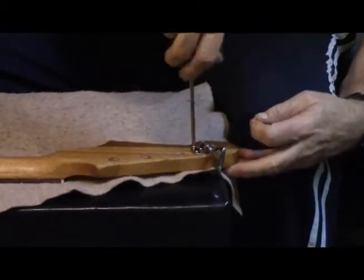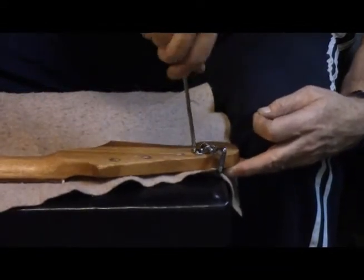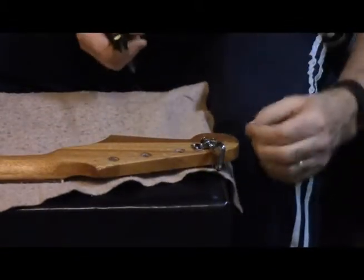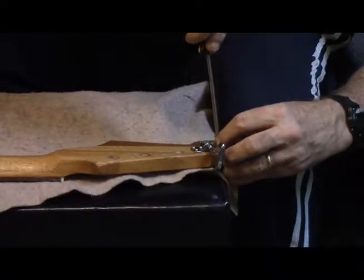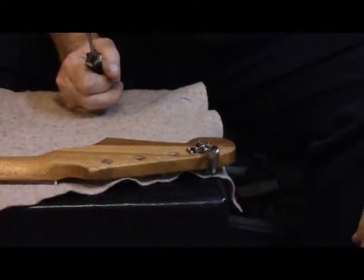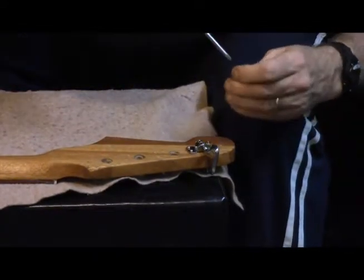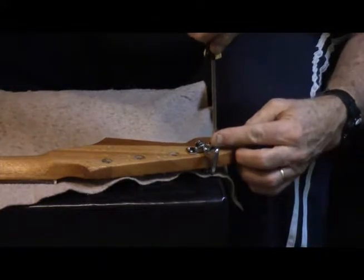With that starter hole, it just goes in much easier because that gets it through the finish, whatever that veneer stuff is that's on this wood, and down into something that the screw can actually catch onto. So, if the screws will stay where I put them, then we can get this done.